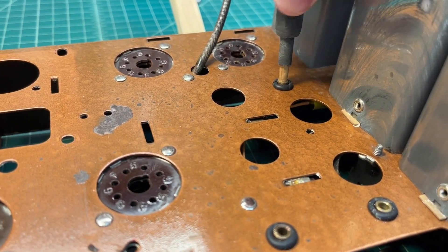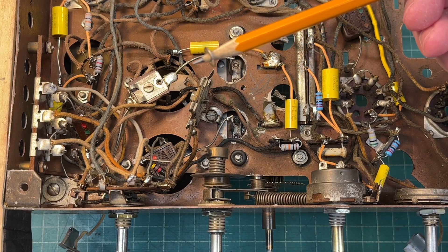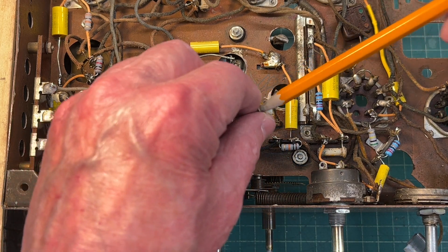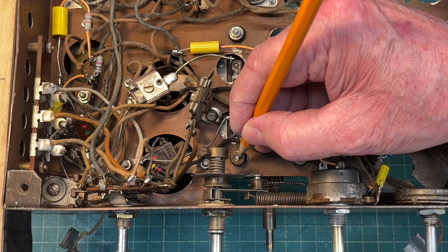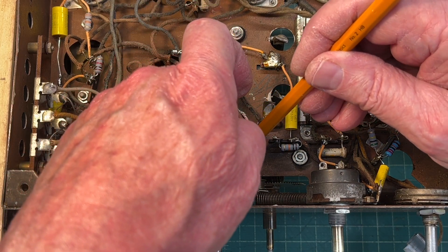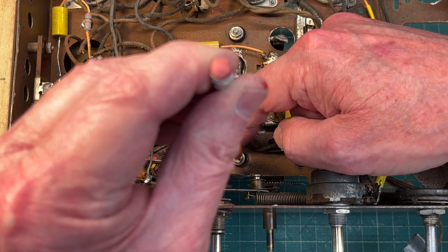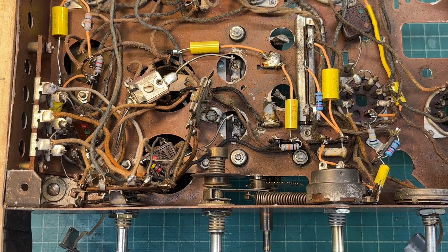You can see putting new grommets in around the brass spacers. I think I've demonstrated this before but it's been some time — it's a handy little tip. You can see I've got the washer placed here on the pencil, pencil point on my fastener, and I just drop it down on. We'll do the same thing for the nut to guide the process. Just something to keep in mind if you've got those awkward fasteners. You can see the new grommets in place now for the tuning condenser. Let me go ahead and get this thing soldered back in.